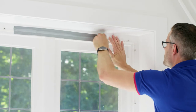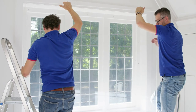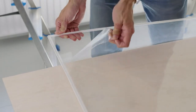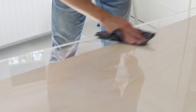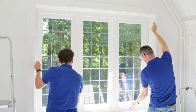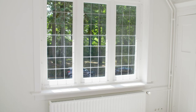When all the glazing clips have been secured, the duct tape can be removed. Open all glazing clips and remove the secondary glazing. Now you can remove the protective film from the other side of the sheet, and clean the secondary glazing well with an anti-static cloth and anti-static cleaner. Never use glass cleaner, as this can make the secondary glazing dull. When clean, place it back and tighten the glazing clips so that the window is fixed. And you're done.